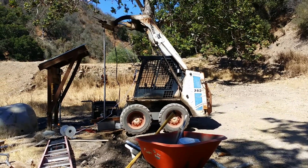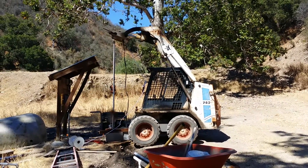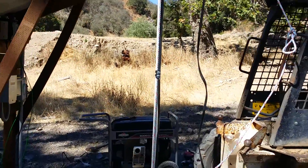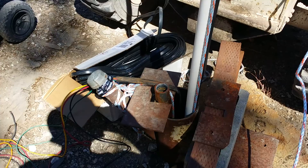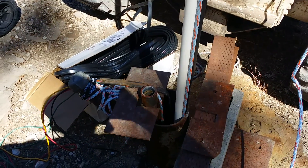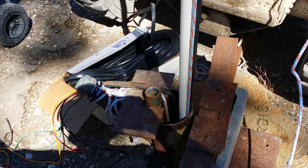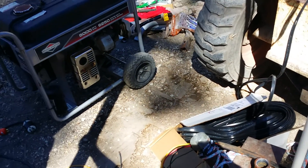Here's part of my solar well project. I'm using my Bobcat kind of like a little crane — not really, just somewhere to hang the rope and wire from as I feed the pipe and safety rope down. I'm putting in two pumps here. There's an existing 220-volt inch-and-a-quarter drop pipe coming up with a safety rope and wire, and I'm putting in a solar pump — a four-inch 220-volt AC well pump running off a 5,000-watt generator.